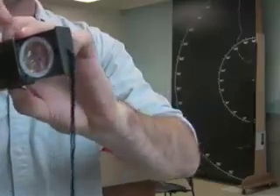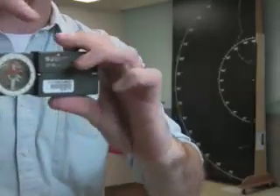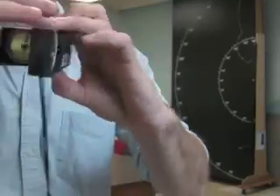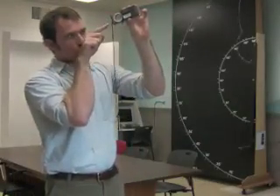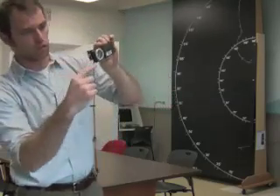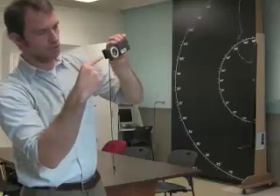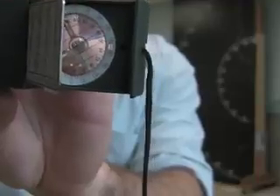You can see this gauge on the back — this other set of numbers — is totally separate from the front when you were using the compass. Using this, you want to hold it at eye height, line up with the building, and then you're going to read the values on the back side through the mirror. You're looking through here at this mirror to read this gauge, and you'll see the small orange line that will always be vertical and will give you your angle.